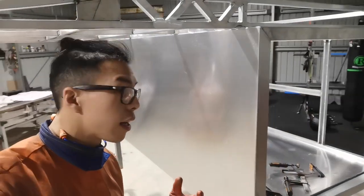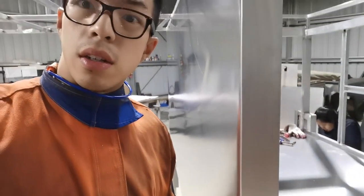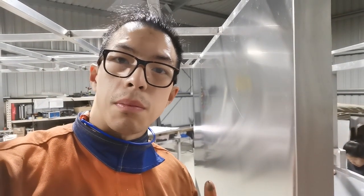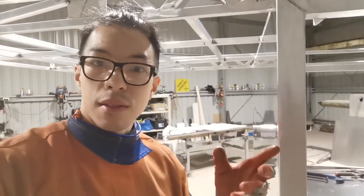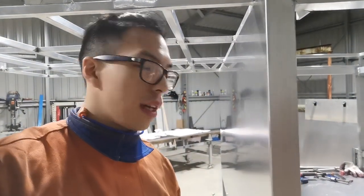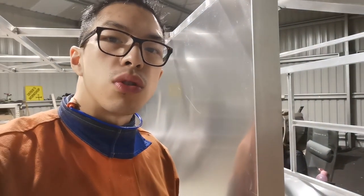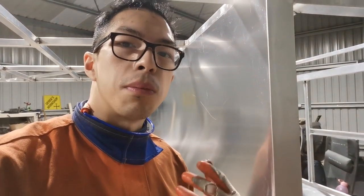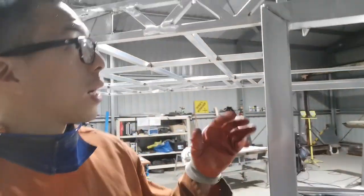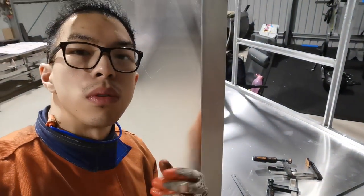Now, there you have it. After these bends, these are really sharp bends. And that is very nice. So if you haven't got a strong enough bender to bend a bend like this, you can weaken the bend line and then put it in your normal bender. And that way it will give you the result. But keep in mind, it may not be as structural as a normal, industrial bender bend. But if a panel is what you're after, then this will do the trick.